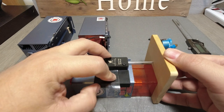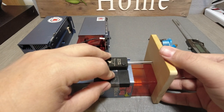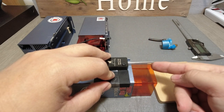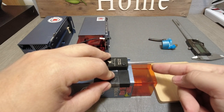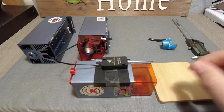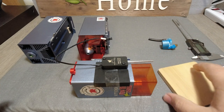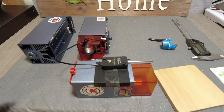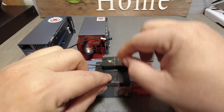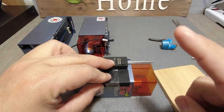That is where you want to fix this, because when you remove your material that means the actuator is just a millimeter below the point of contact. That is going to be the best position for your sensor — it's going to leave you still enough clearance so you don't hit anything while engraving or moving around with your laser, and in that way you also ensure this is completely aligned and square with your unit.